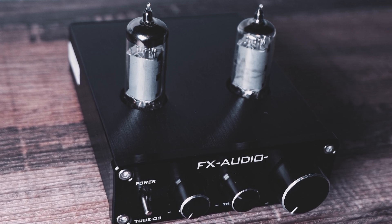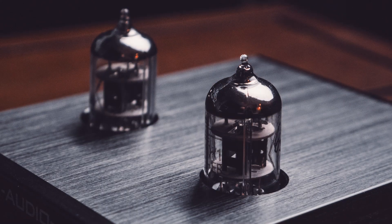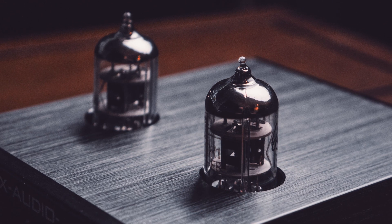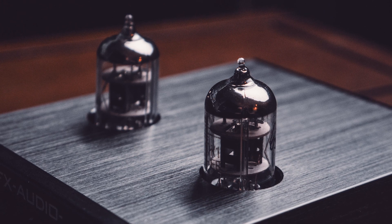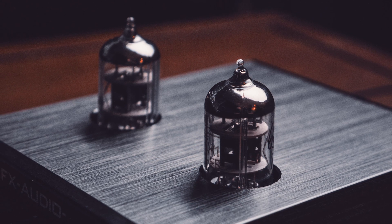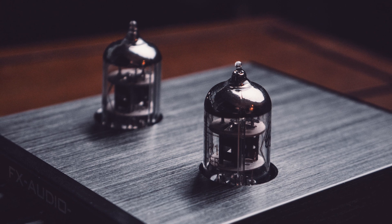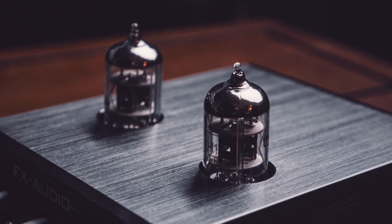Below this video you will find links to all the products used in this experiment. Before taking on this project a few months ago, I wasn't aware that the tubes themselves play a significant part in shaping the sonic personalities of an amplifier. However, after just spending around $20 on a pair of Soviet tubes — or valves as they are sometimes referred to — you can very well enhance your experience with the amplifier. Certain tubes can tame an overly bright or harsh amp and increase its headroom. I'd encourage you to experiment with different tubes to find that sweet spot.